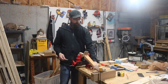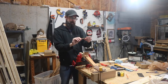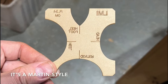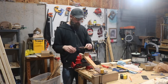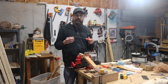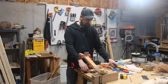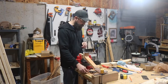I've just started rounding over the neck, and I've got a template I ordered from LMI that goes with the OM plan I'm using — it's supposed to match the plan. I'm going to keep checking with it as I round over the neck to make sure I'm where I'm supposed to be. I'll keep using the spokeshave. I've also got a Shinto rasp I bought earlier after seeing people use it, but for now I'm just going to use the spokeshave since that seems to be working okay.